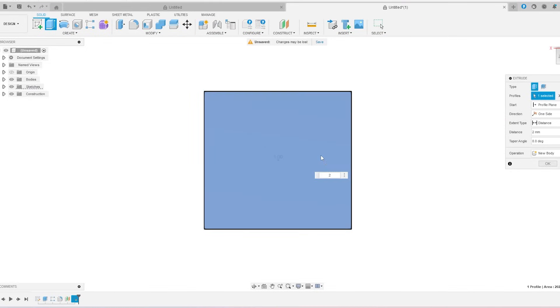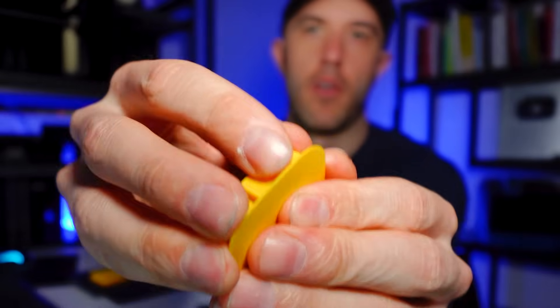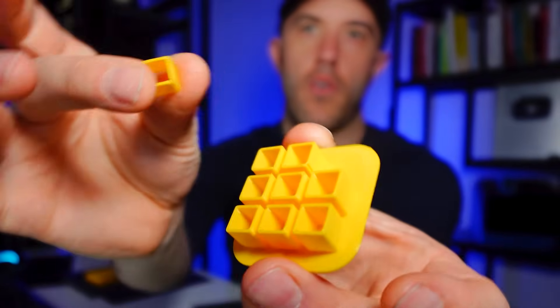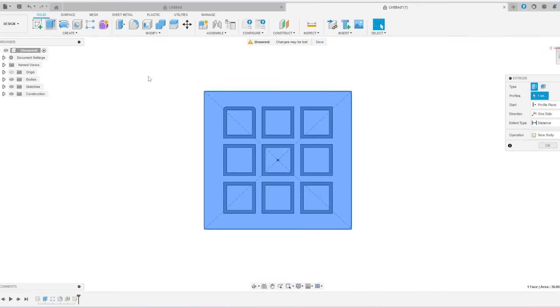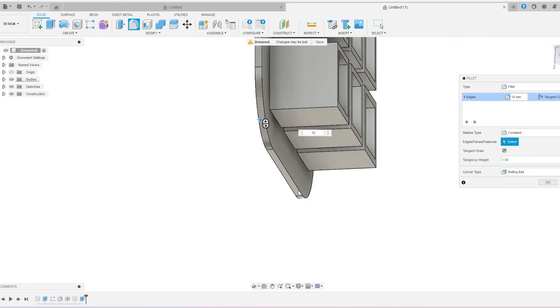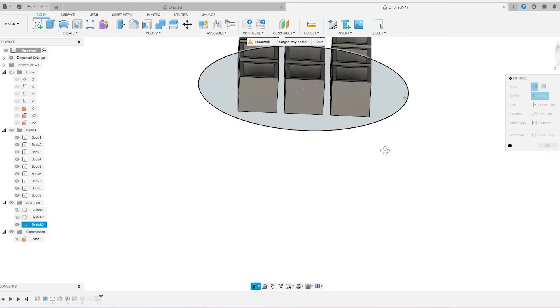Design the parts well, then put the raft underneath. The ideal spacing between parts and raft is a minimum of 0.2 millimeters, but you can go up to 0.3 millimeters — I recommend testing this out. 0.3mm is the safer direction if you want parts to pop off loosely; 0.2mm works but risks parts sticking very rigidly to the raft. The raft itself should be one millimeter thick so it's a fully solid plastic part. Also, make sure to round the edges of the raft — if you make it a perfect square it can peel up with high-warp materials like matte black PLA or PETG. Round the corners or use a circle underneath your group of parts.